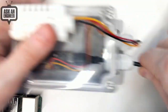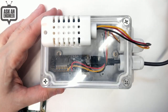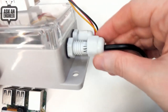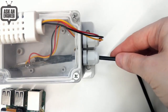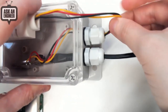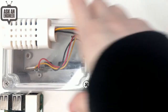Let me show how the cable gland works. Say you've got a weatherproof setup with a Feather that's wireless and battery powered, and you have a sensor on the outside or a cable for recharging. You put the cable through the gland, and there's a little O-ring with small fingers. When you tighten the nut, the fingers hold the O-ring tight against the cable — so even if the cable is a little lumpy, you get a watertight seal. You get two cable glands included, and you can drill more holes to add more. Good for antenna, power, solar — great for outdoor projects. It also comes with mounting flanges.